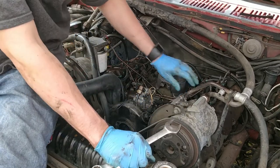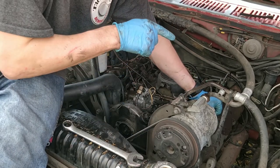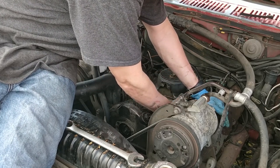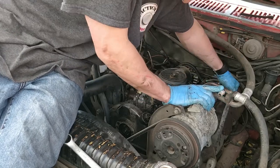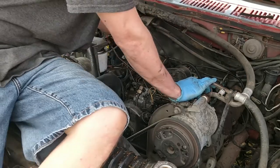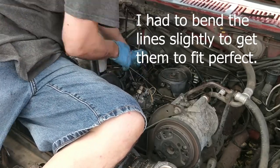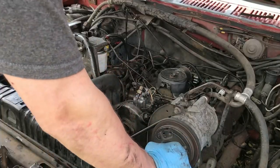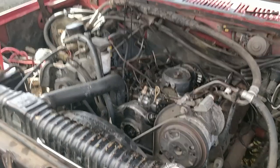So you don't want to burn it up. So I have fuel coming out of each line. So now I'm going to hand tighten these guys down. Pause this while I get these lines on. All right, let's get some bleeding action going.